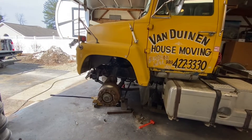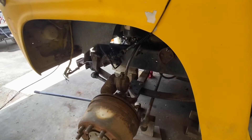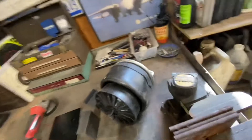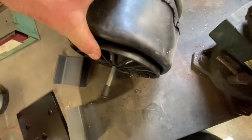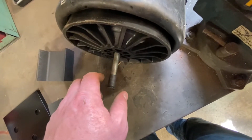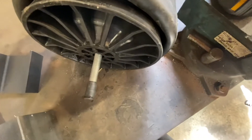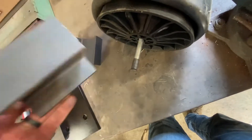I've got the axle pushed up into place, located on the centering pin, pin cut down, everything pulled up nice and tight. Got the first plate test-fitted and everything looks good. I'm about to make some cuts on the C-channel for the lower bag mount. You can see it's fully collapsed there — they give you a really long stud, and I need a stud that's not even close to that long, so I've got to cut it down.